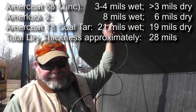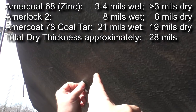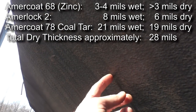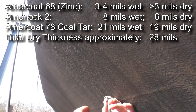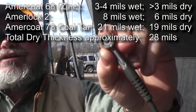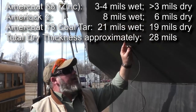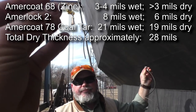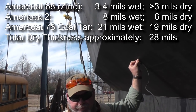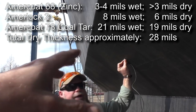28.8. I like that. 29.4. Now, it's not a really smooth surface, so does it read from the paint, or does it read from the tip it's touching? That transducer has a point, so it's based on that diameter. So within that area, from that transducer point. So a little wave or bump in the paint can make a difference.